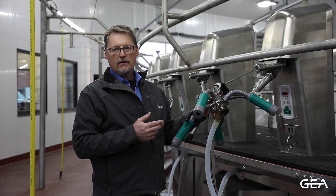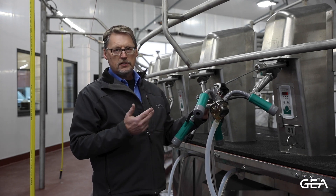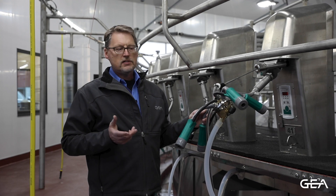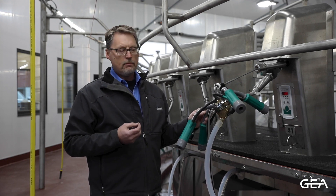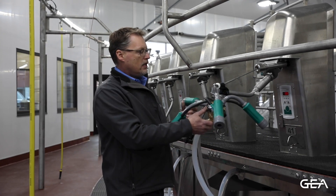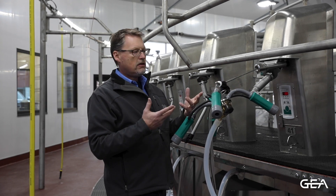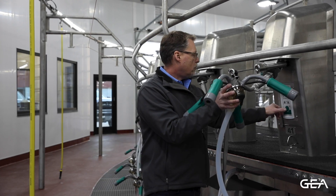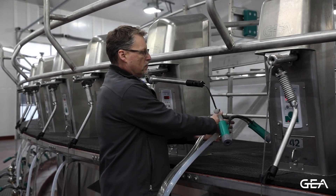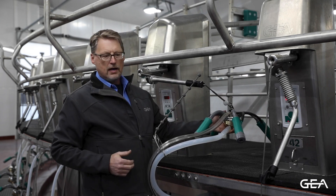This arm is designed to have the unit in the down position for cows getting off and on, but at the proper attachment position it will be lifted up in presentation mode as we see here. The function of the arm is to ergonomically help the operator attach the milker unit — the operator grabs the cluster, pushes the arm forward, which releases the rope and starts the vacuum. The main function of the operator at that point is to attach the unit to the cow and then hang the posiball strap, which adjusts the hose.